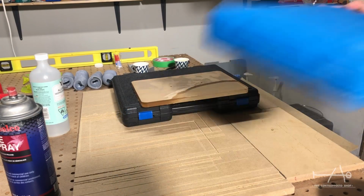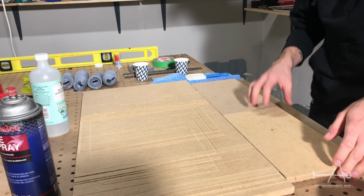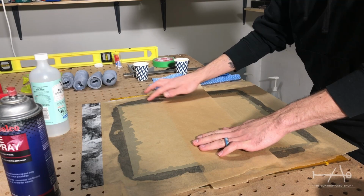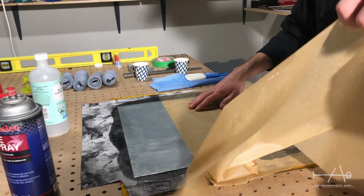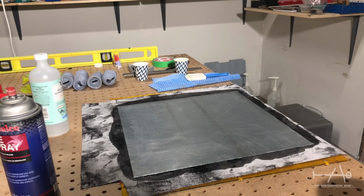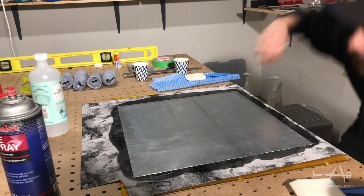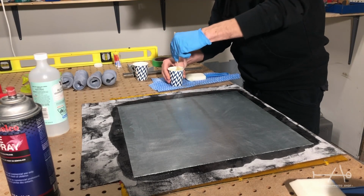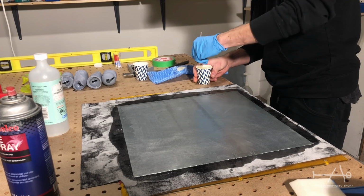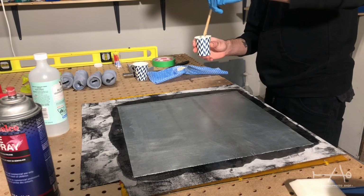For this video, we've tried to have two sides on our build plate. I can't really suggest you do that on a big surface like ours, because you need to be very careful to have an even thickness everywhere to have a level bed, but I guess on a smaller version you should have no problem. On the textured side, we basically do the same thing.